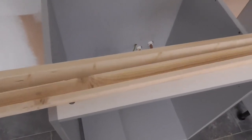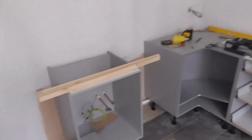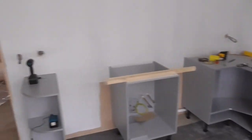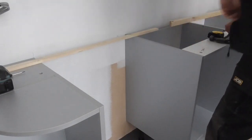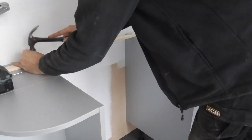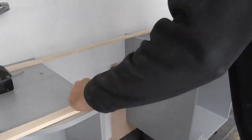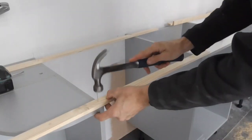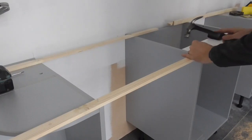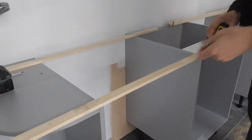And what I'm going to use, I've just robbed some of the doorstop heads that we'll use later on when we come to hang the doors. Basically what I do is I span them across this opening and pin them into the top so that it keeps that distance exactly right. So I'll do that now, and then we can get on to setting those and fixing them to the wall. We'll just get it down into that gable. Now I'll just check the measurements.